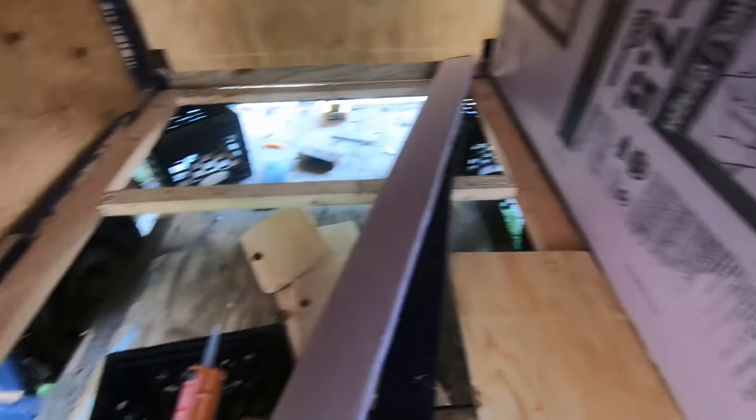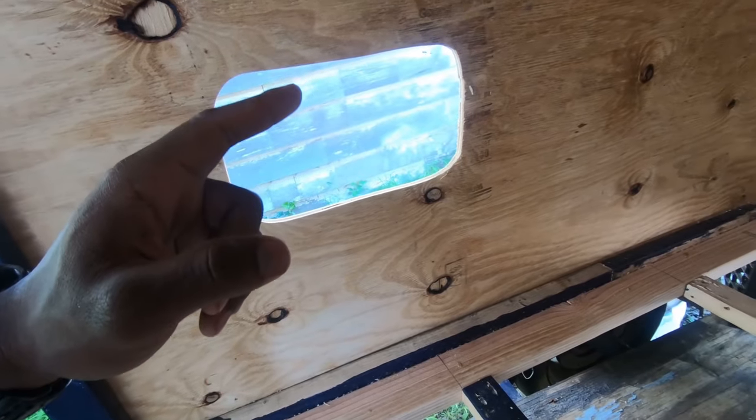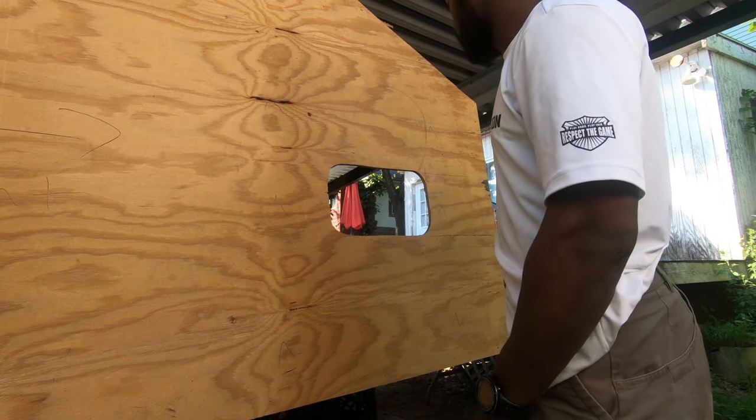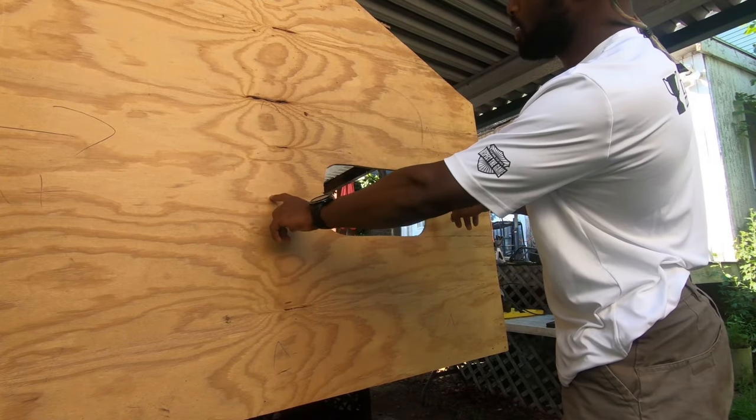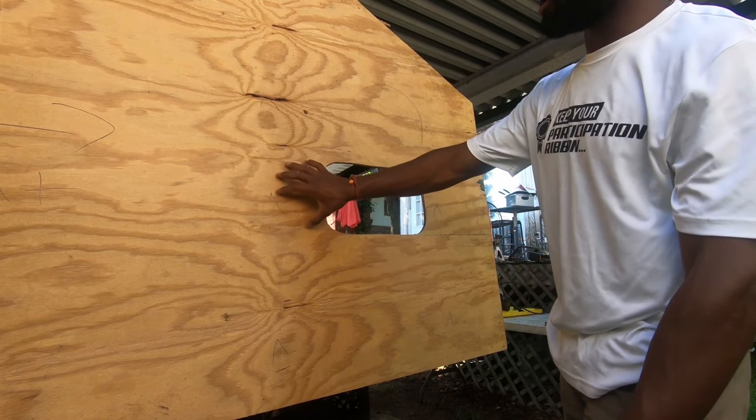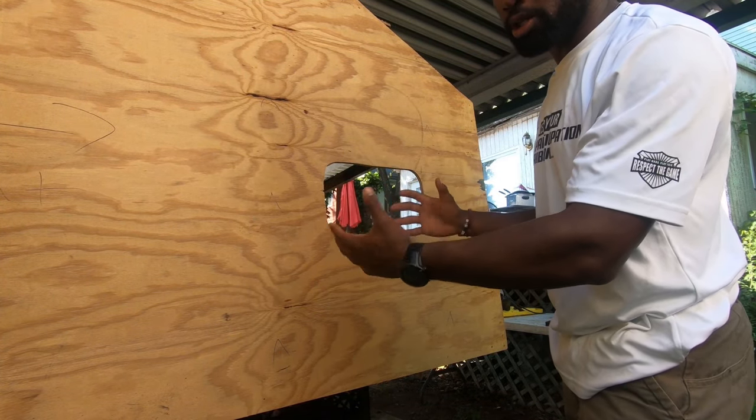I realized I kind of messed myself up a little bit because I'm going to have kind of a hole inside of it. So I'm going to have to come along the edge a little bit more so that I have somewhat of a template — so I can draw that out and stack up the layers of the boards as well as the insulation. I'm not sure if I'm going to use fixed insulation or get some thinner stuff, but that's one piece getting done today. So I'm drawing on measurements for the door now — I need a little bit of excess from where I cut this hole out so that I have a nice solid piece of wood to use as a template.